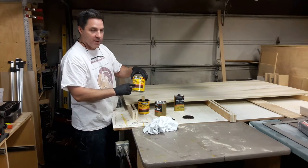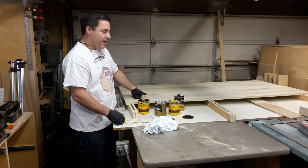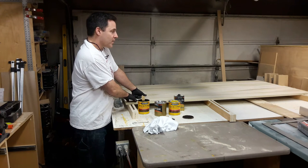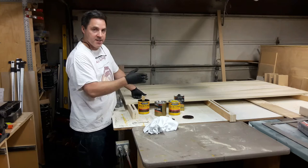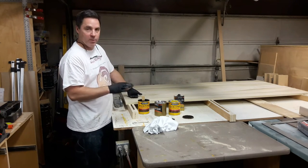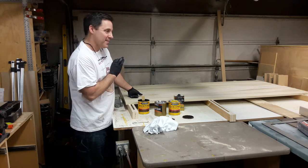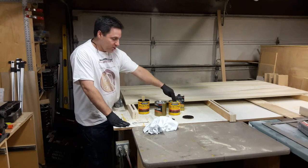Then we're going to put on another color — red mahogany. It's not going to absorb as much into the wood as the first coat because the first coat got there first, but it will enhance the color of the panel slightly. I don't want to say red because everybody freaks out — red mahogany is actually mostly brown. You're softening up the dark walnut to where it's a warmer but darker look, and there's not that much red in it.